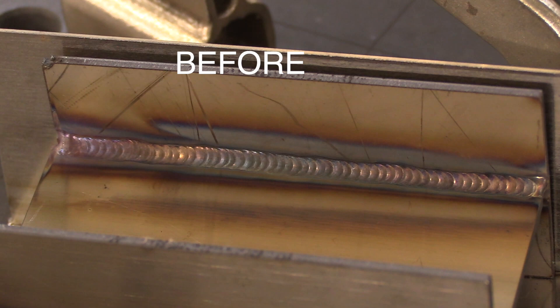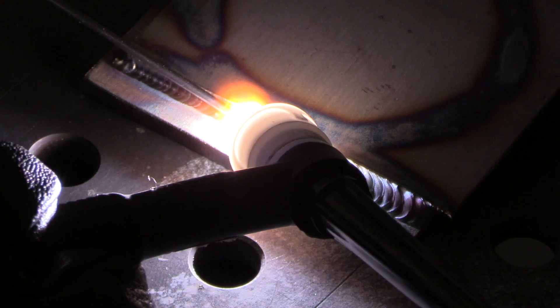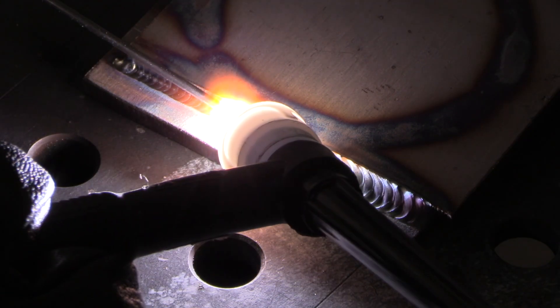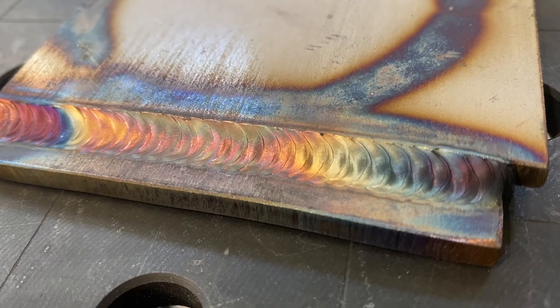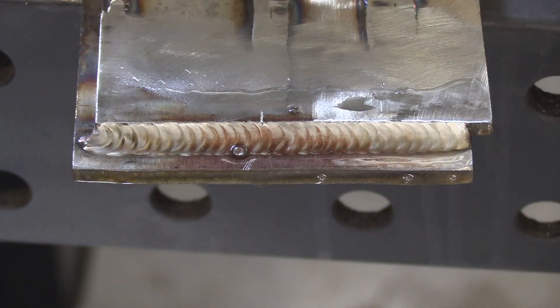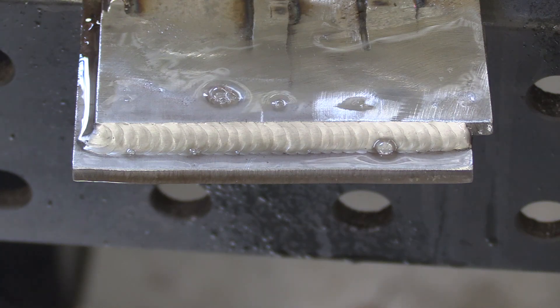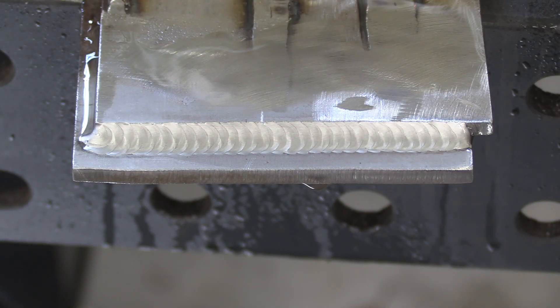This is not very corrosion-resistant. This is very corrosion-resistant. Let's take a look at another stainless weld. This is the second pass where I'm weaving here using the laywire technique — a two-pass fillet weld on quarter-inch 304L stainless using 308L filler metal. Those colors aren't very corrosion-resistant. When you remove them and remove a little layer of material, you provide a passive layer that's much more corrosion-resistant.